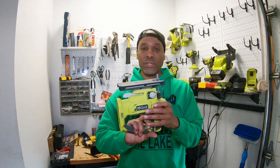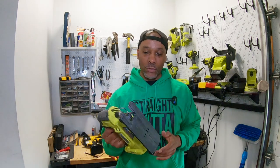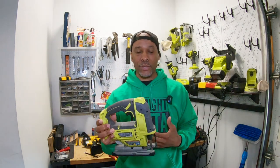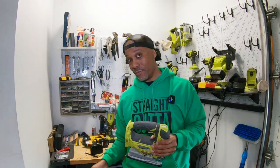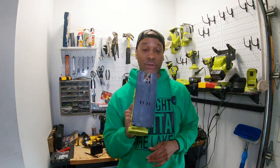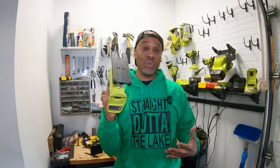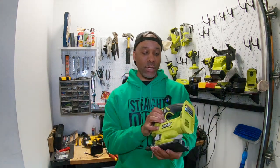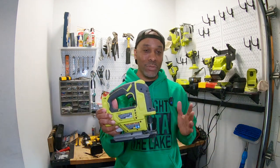I went to a jigsaw and was very happy — the cuts are much cleaner than the angle grinder and it's faster. You'll need to buy blades since you'll go through them depending on how much you're cutting. You get much cleaner cuts, it's faster, and there's no aluminum dust to breathe — just shavings you clean up with your shop vac. I actually built my first boat primarily with one jigsaw, cutting everything from aluminum sheeting to all the aluminum angle I needed.